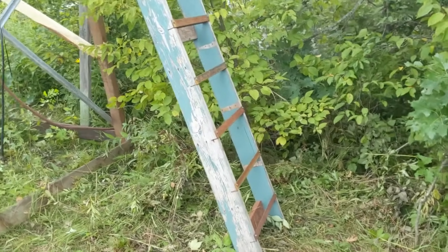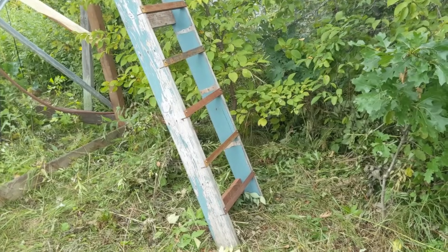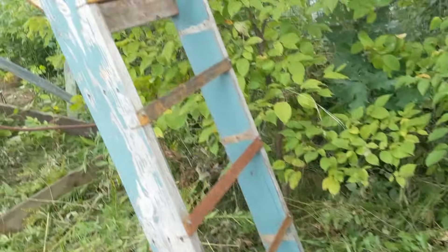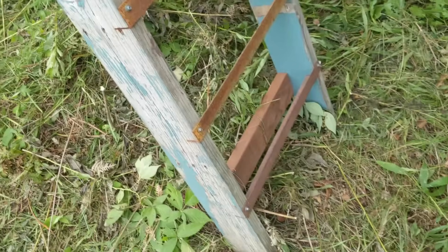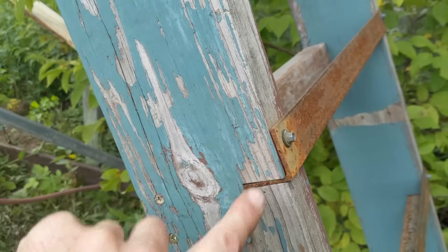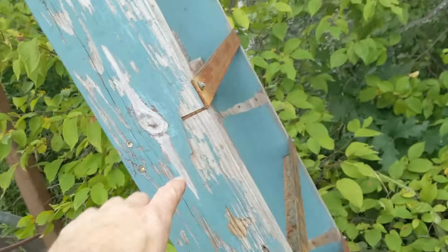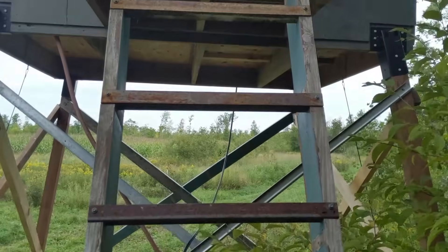The ladder's made out of 2x6s from that same free deck material. I don't like going up plain 2x4s — I'm in northern Wisconsin, so a lot of times when I'm hunting, it's winter and you've got snow on your boots. So I took angle iron from a couple of old bed frames, cut them about 2 feet long, drilled a quarter-inch hole, and ran a two-and-a-half-inch screw for holding roofing sheet metal down. I clamped them together, ran saw cuts just deep enough to set the angle irons in. So I've got this nice no-slip thin edge on the ladder rungs.